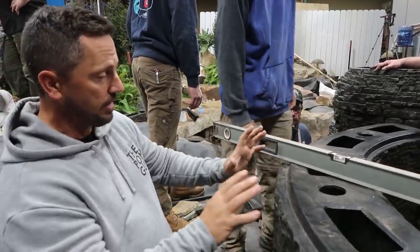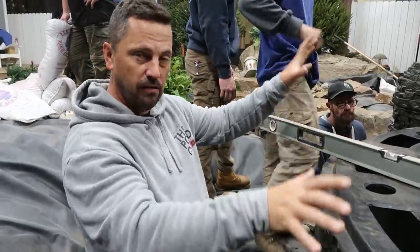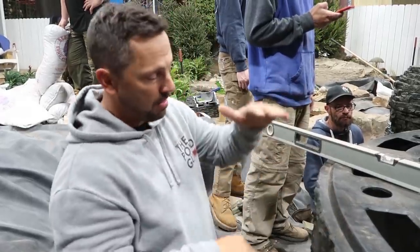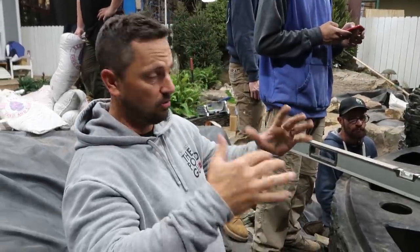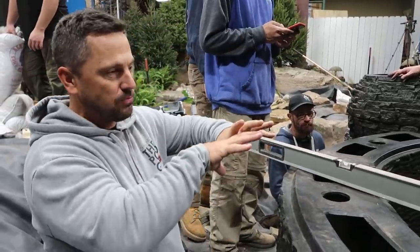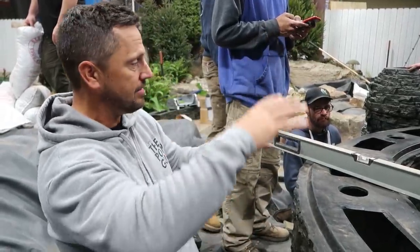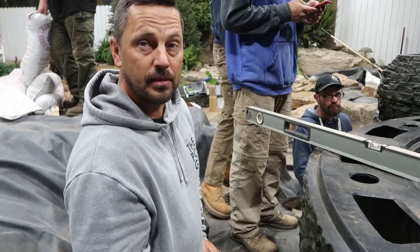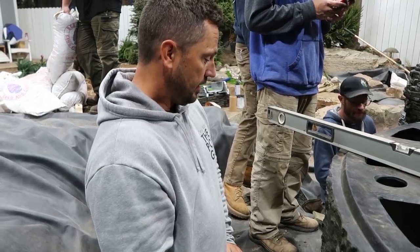We've got a base set for our foundation. Right now what we're doing is getting these really nice and leveled because if we don't level them, it's going to come off weird in the face - it'll be heavier on one side, lighter on the other. So it's really important we get these leveled. We're going to fill these with about a foot of pea stone - that's just going to provide ballast, hold it in place so it won't move around when we get the back filling and putting rocks around it. Now that we've got this one set, we get this one leveled up and that sets the tone for the rest of the fountainscape. Then we can marry in our large urn, and all those tops that Brian cut can get put on and we can finish this thing up and get some plumbing in here. This just goes to show you how important laying everything out, dry fitting it, and getting the foundation set is so that everything else goes nice and smooth.